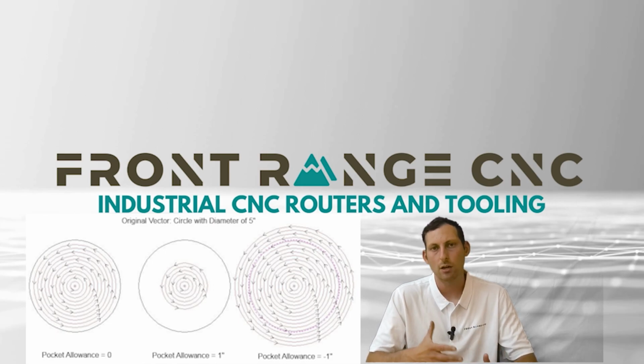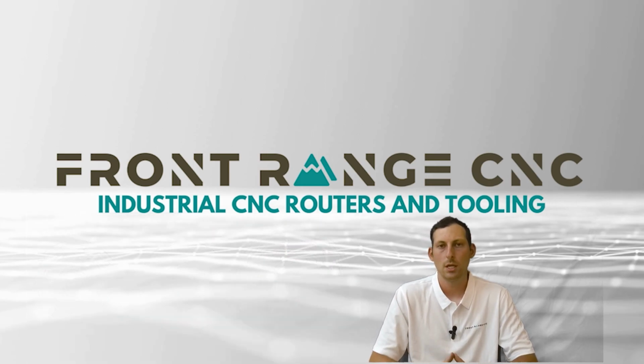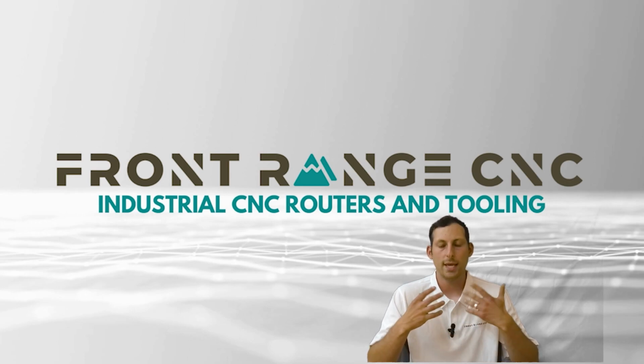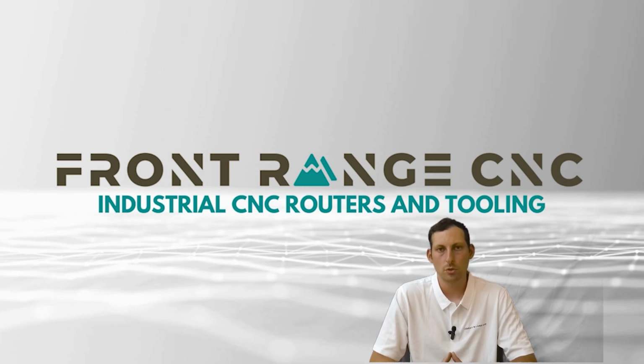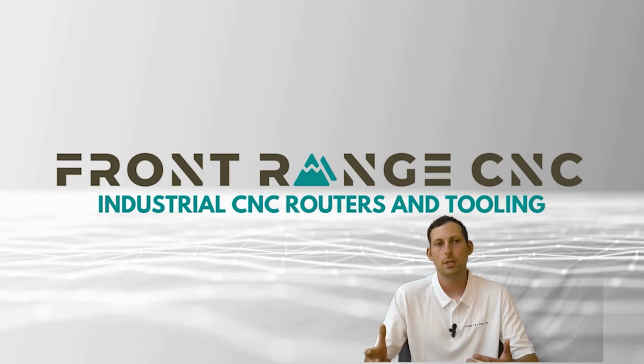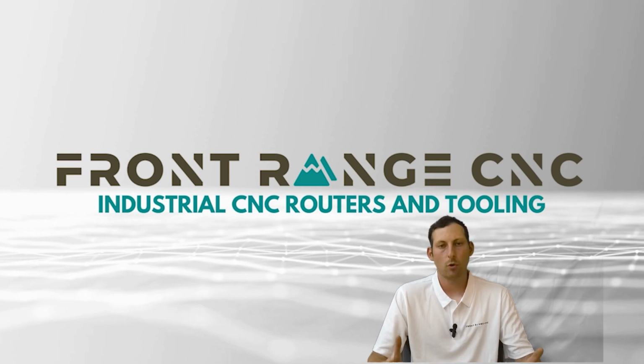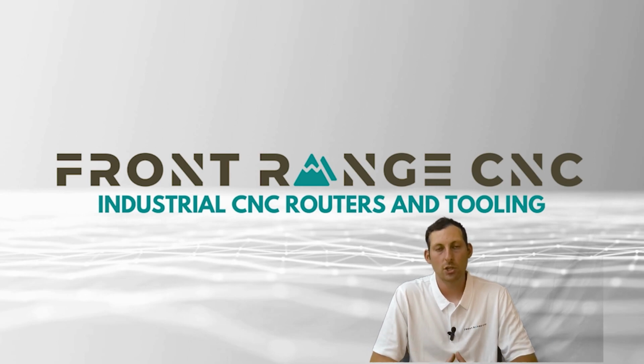And that'll really depend, again, on what material you're cutting and how much tooling you're needing to use for that particular job. But for the most part, if you just know generally what those five bits are, upcut, downcut, compression, straight, and O-flute, you can then really cut any material using a CNC router. As long as you've got a large 4x8 or a 5x10 with a large enough spindle and some method of holding your part down, you can see how, just because you're a cabinet shop, you do have the ability in-house to cut essentially anything a router can do.